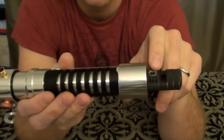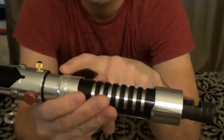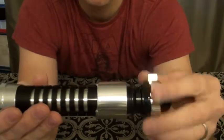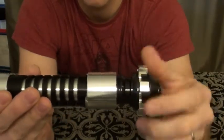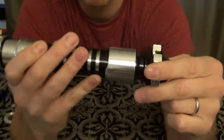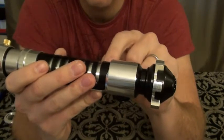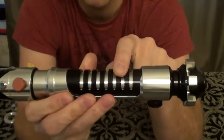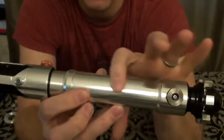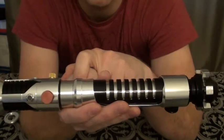I'm going to try and see if Stoke's ultra-low-profile kill key works. If not, I've got the deep sleep mode. There are some wires basically right in here, and what I end up doing is just slowly putting this on. Because the pommel is kind of long, I got the speaker basically going up right against the pommel. For a 20mm speaker, it's loud enough. I'm sure if people have found creative ways to do either a 24, 22, or even a 28mm speaker, that would be a lot louder. But some modifications have to get made to the body of the hilt itself on the inside.